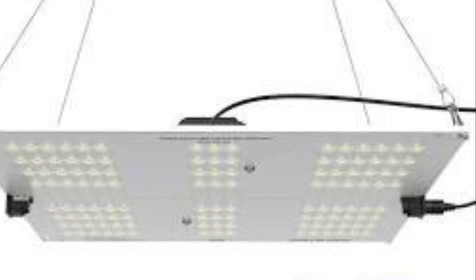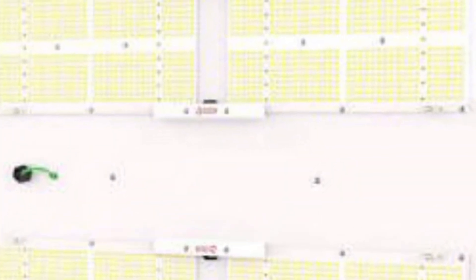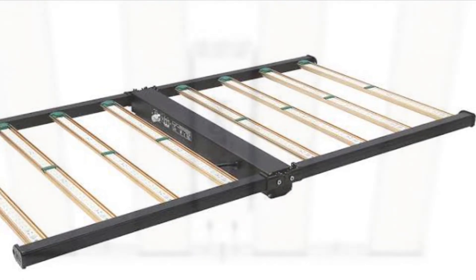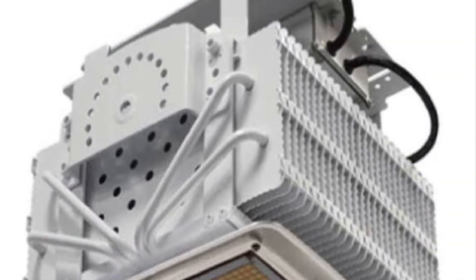The diodes are very susceptible to heat, and if they don't get rid of that heat with good ventilation and fans, you're going to burn up diodes. So you'll have a fairly inexpensive light, but it may not last as long if it doesn't manage that heat with heat sinks and fans. Just be careful when you buy these. You can fully grow plants under these high-intensity LED lights, and with some brands you can get just about the same output as you would get with a high pressure sodium or metal halide. It's going to cost you more upfront, but your energy use is less. The pros are that you're using less energy while getting the same output. A con is that it costs a lot more upfront for the equipment, though you will save on that energy bill over time — so if you can come up with the money, it's not a bad plan of action.